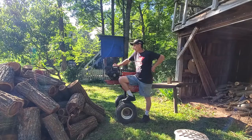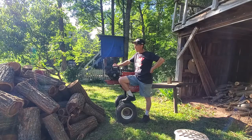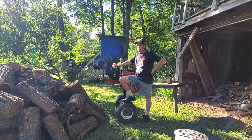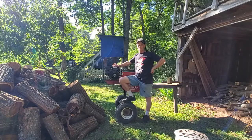And with my chimney flue system, it's all stainless within stonework, and it hardly ever creosotes up. But with this new wood burner, it's turning up some temperatures. If you have a really good hot fire, you shouldn't build up creosote. It's when you damp the fires down and you've got a lot of smoke, that's when you're building creosote. My chimney hardly ever smokes anymore with this new wood burner we've got.